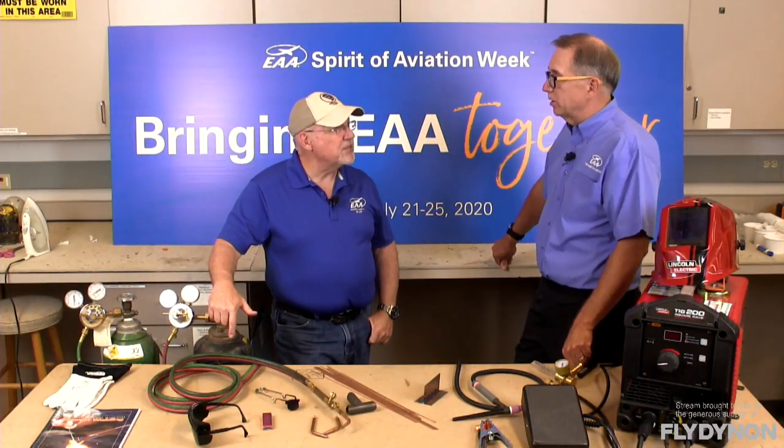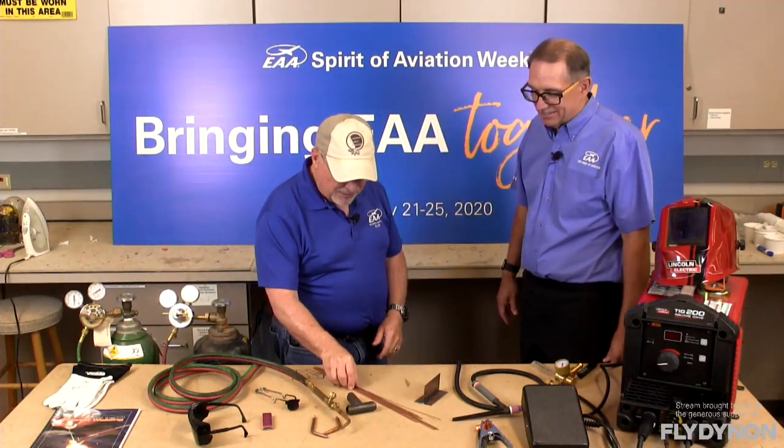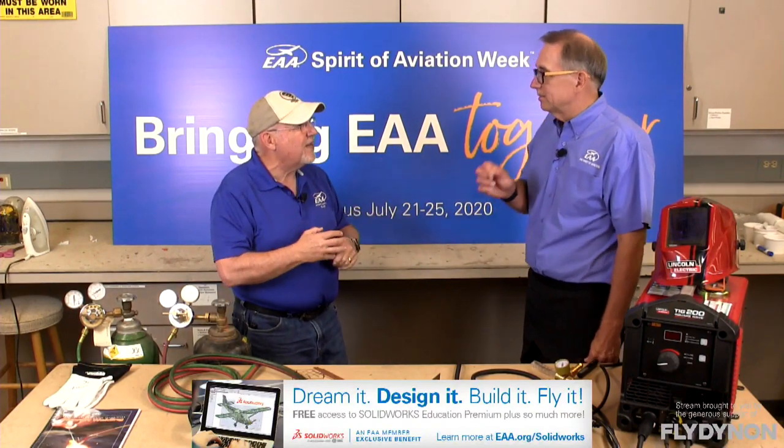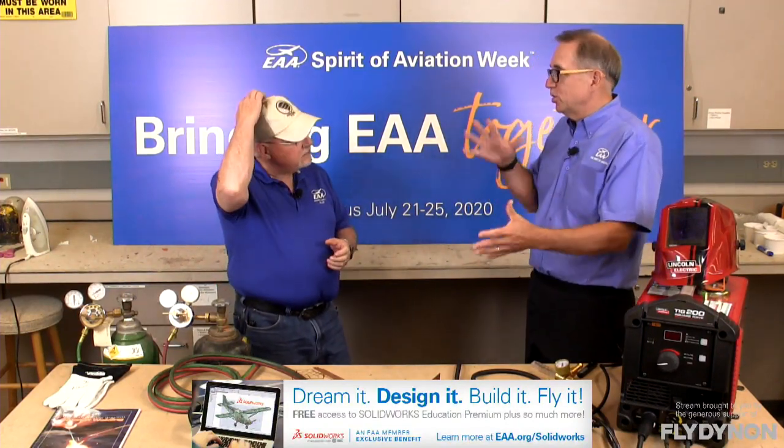That's kind of the overview of gas welding. As time has gone on, we've advanced to much more use of electric welding — first the old stick arc like you've seen in movies with shipbuilders and bridge builders, which used huge electric machines with giant transformers requiring 220 volts. Now look what we have today — this is a Lincoln Electric TIG welder. It's a very simple piece of equipment: you can pick it up and carry it and plug it into a regular wall socket, no special 220-volt outlet required. TIG machines back in the day used to be huge, but now with computerized technology and electronic switching rather than big transformers, you can plug this into literally a 20-amp circuit.